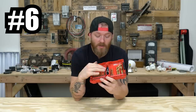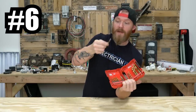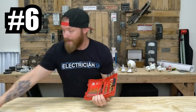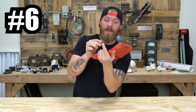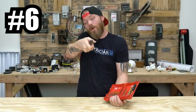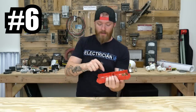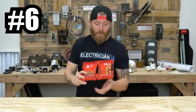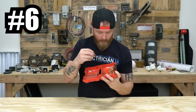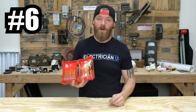All of these fit in an impact driver, so they're not like a normal drill bit that you'd have to stick in a drill, which is cool. I like getting anything — even my paddle bits — with ends that fit in an impact driver so I can just slide them in and use them with my smaller drill. There are times where you have to get in at a weird angle and you need a shallow drill to get in. Pretty much everything I buy is equipped to fit on an impact driver. These are great for drilling metal — they have a 135 degree angle on them, they are kind of self-tapping, but they're made specifically for drilling metal. As an electrician, you're going to be drilling in metal all the time.